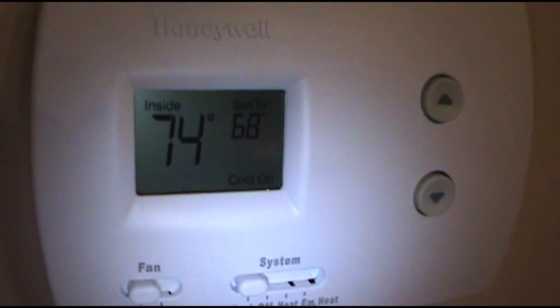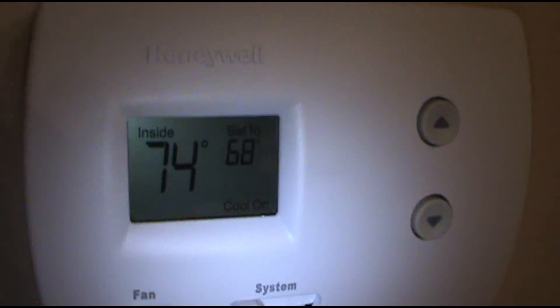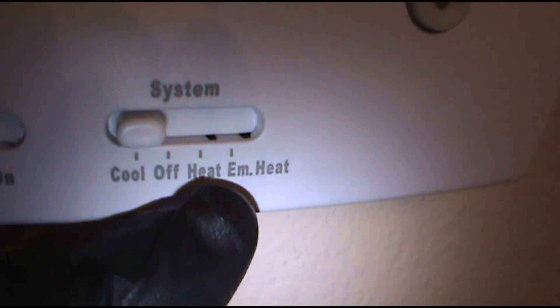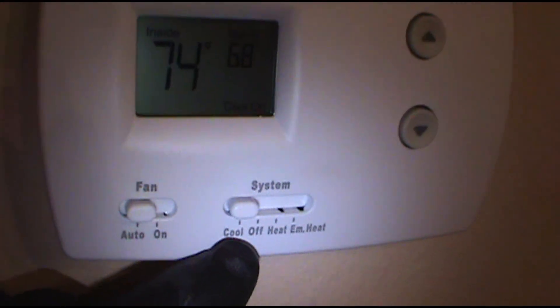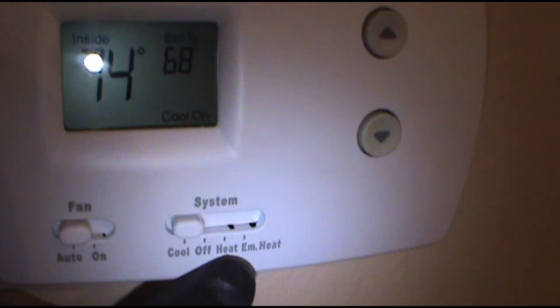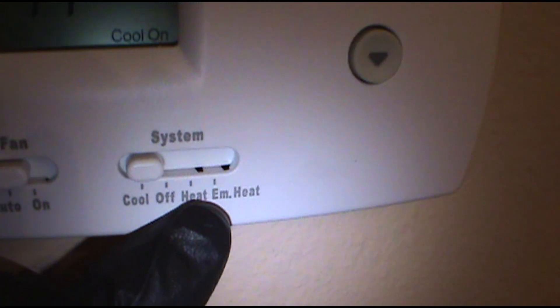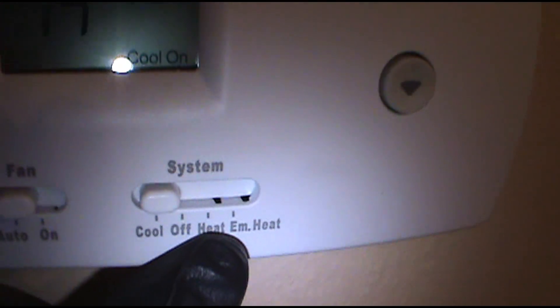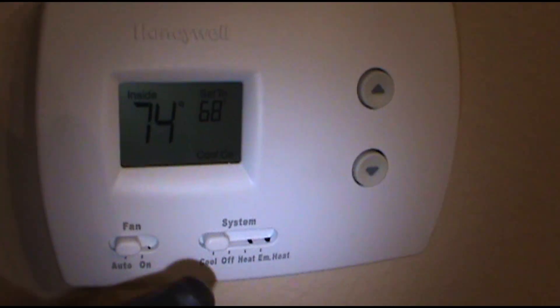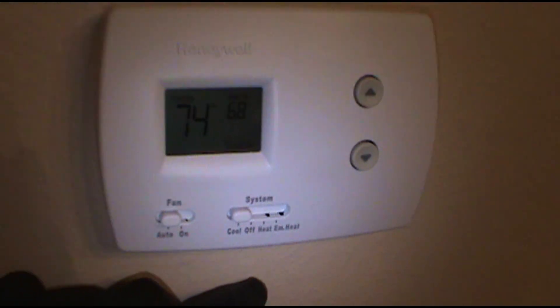We got a call today about an AC unit that's not turning off when it reaches the set temp. When I showed up it was originally in heat mode — I'm the one who put it over to cool because I want to check the refrigerant and it's hot outside. Here in North Florida around this time of year it's cold at night, so she originally had it in heat. A few weeks ago she put in a work order, someone said it checked out okay. Something's going on in heat — the inside is running and it's not shutting off when it reaches set temp.